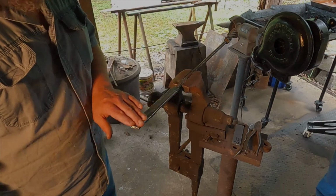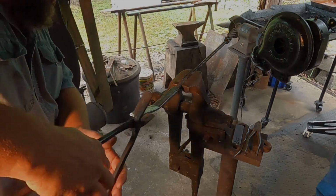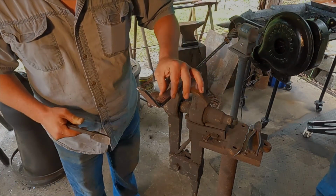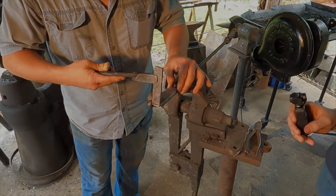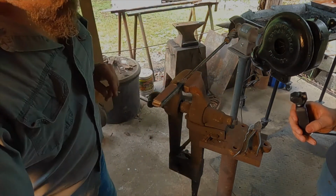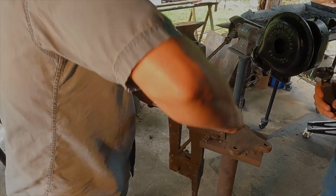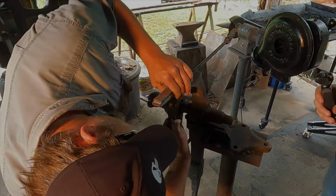We have our cable billet all cleaned and polished on the face, and we've got our cuts partway through. So we're going to start bending this around, just like that. Lay our spring steel in the center and just go ahead and bring it on down like so. Then we've got a piece of wire here that we can just go ahead and add at the back as a little bit of insurance and give it a good twist to hold it tight.